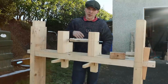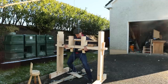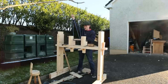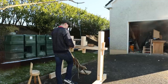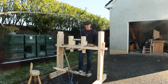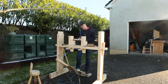Now that that's in place, I need to worry about setting up the actual pole part of the lathe. You can see it sticking out there in the top corner of the screen — all I did was attach a rope from that, wind it around the workpiece, and then attach it to a foot pedal here. I was using sisal because I prefer using natural materials where possible, but it was too thin and it kept breaking, so I need to find some thicker sisal or maybe hemp rope. I just don't like using polyester rope.